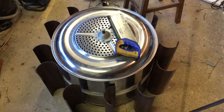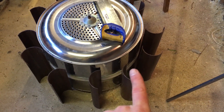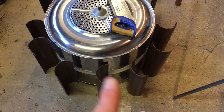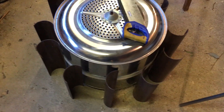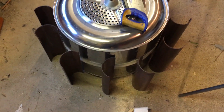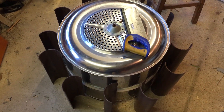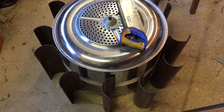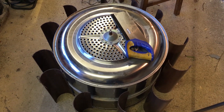I went for 12 in the end — nine looked a little sparse. I'm thinking I want as many buckets engaged at once as possible so the load is shared and there's no shock loading when one picks up the water flow. 12 also looks right, and we've all seen a lot of water wheels so that feels better. The easy part was cutting the guttering; next I've got to make up some metal bits to bolt them down — two brackets per bucket, so 24 little parts to make.